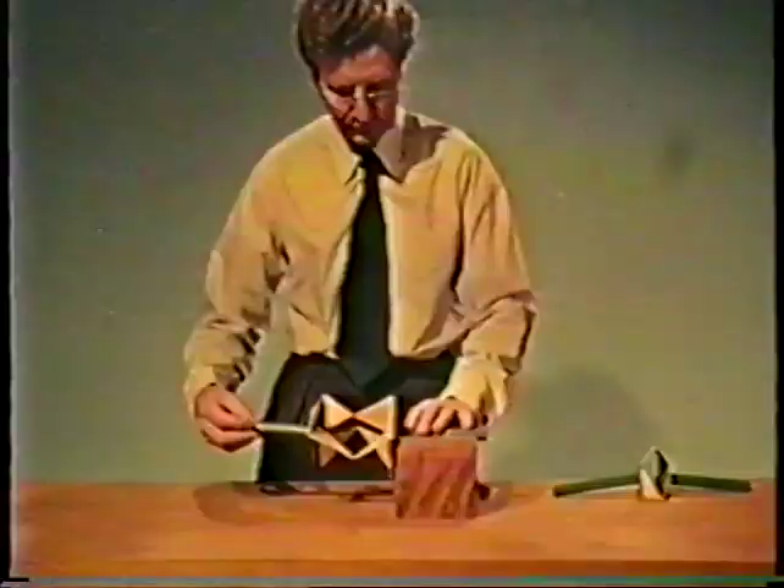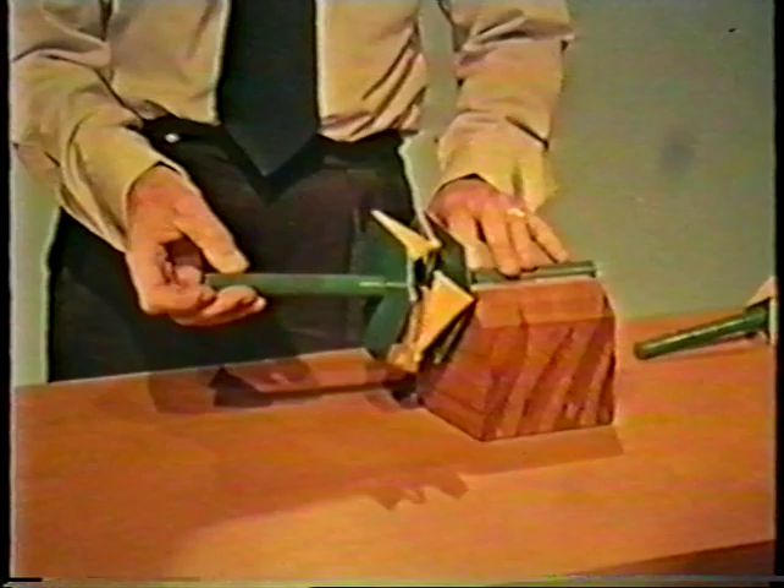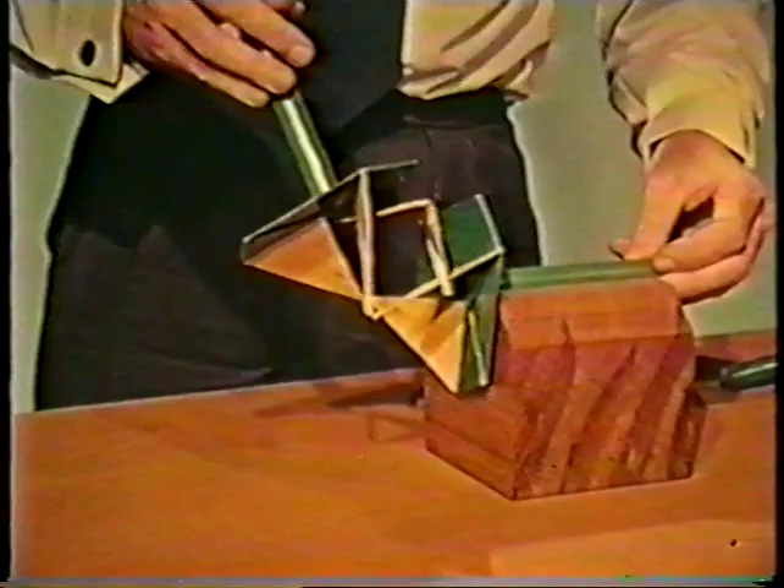This one's based on a tripod too, but designed so that there's a remarkable amount of plunging within quite a small overall diameter. It works even when the shafts are at a full right angle to one another, but when angled as far round as this, there isn't much scope left for plunging. One always seems to lose plunging as one gains angularity.